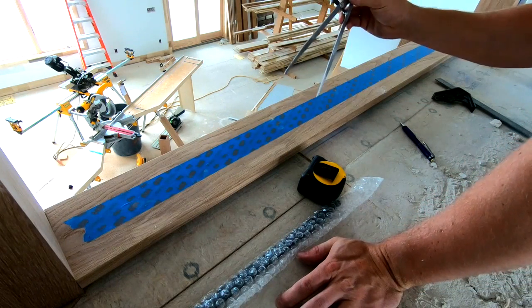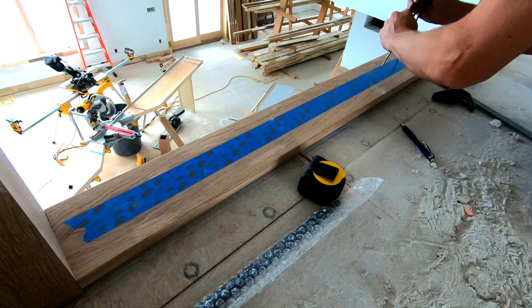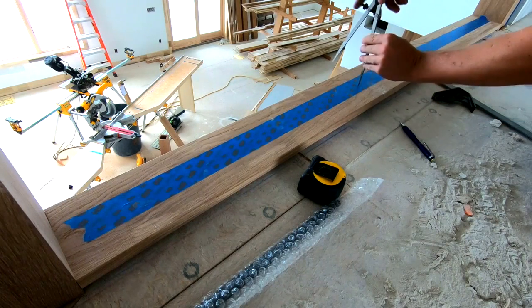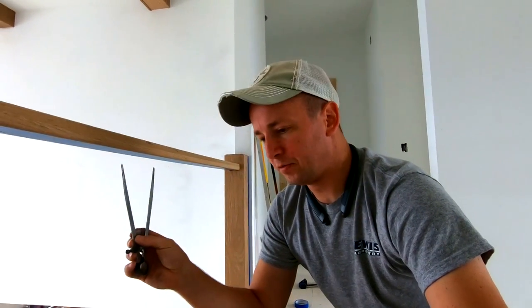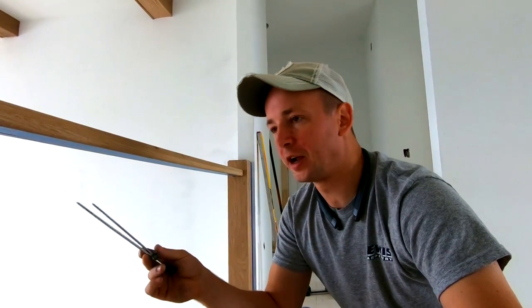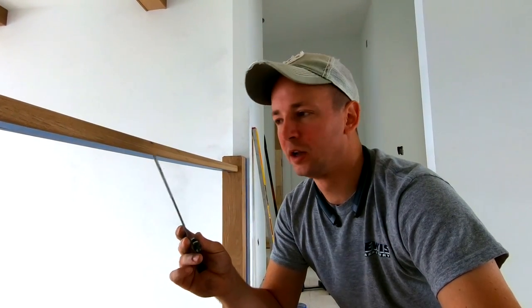This reduces a lot of potential for mistakes. Once I've got it perfect, I push hard with the sharp compass points to make nice indentations in the wood along that center line. This compass is a great tool because most of the time you're not going to have a perfect even number between your posts — it might be something like 72 and 3/16ths, and your baluster spacing might be 3 and 9/64ths, which you just can't do on a tape measure very well. Using a compass really helps reduce errors and keeps things precise.